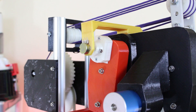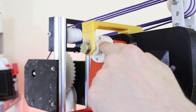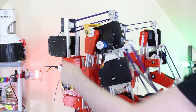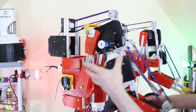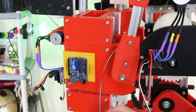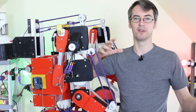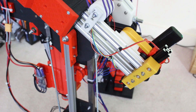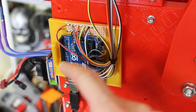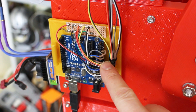There are also shoulder joints, so I've installed a potentiometer here to measure that angle. It has a bracket to the main arm piece and a holder for the pot, so as I pull the arm forward it rotates the pot. That lets me unwind the block and tackle with the gearbox at the back as the arm reaches forward. Each arm has its own Arduino and its own battery, with motor drivers, the hall effect sensor wires, and the pot all wired in, making each arm independent. I can unscrew them and take the arms off, transporting the suit in three sections.